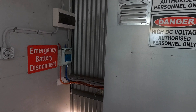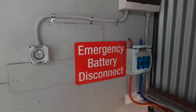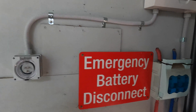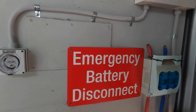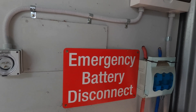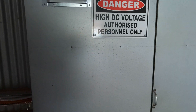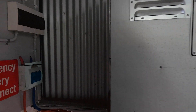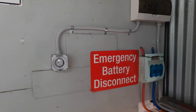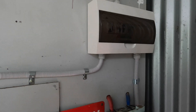We'll go into that cupboard in a minute. So the electrician came and he put the generator input on, which is totally separate from the inverter - it's got nothing to do with the inverter. It bypasses the inverter, meaning that if anything goes wrong in the new power room - let's call it the power cabinet - I can still run the house off the camper trailer or the little Honda generator. We put a whole new board in here.